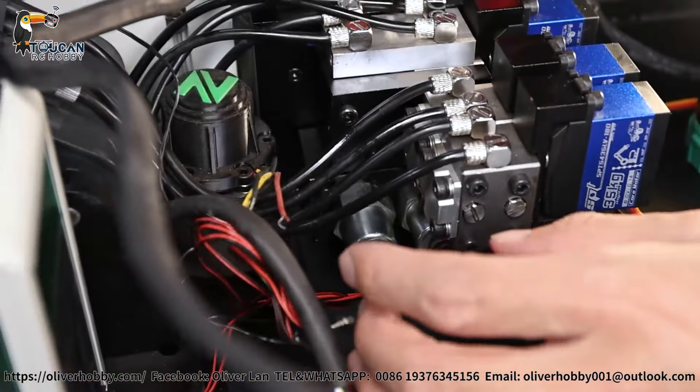Here are all the power connections for the rotation motor, for the slip ring of the two driver motors, and the lights' positive and negative control. Take photos and make note of the sequence one by one of where everything was originally connected. When you reassemble, it's the same position — quick connection. Wires push in and push up to lock; push down to unlock.